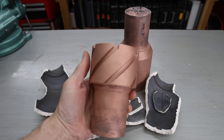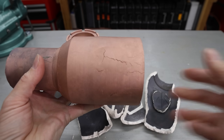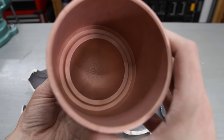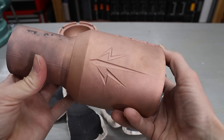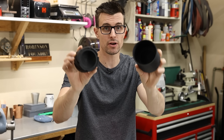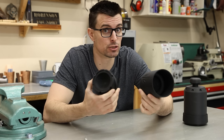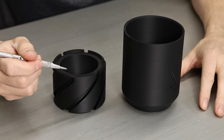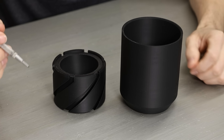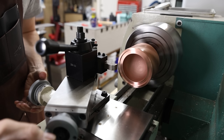These castings turned out excellent and I'm really happy they're finally done. The bell ended up cracking a little bit on one side and I think that was from shrinkage, but as far as defects go it's actually not that bad — I think it'll be a little bit interesting looking when I'm done. I got lucky it wasn't on my logo. When I was designing this thing I had to figure out a way for both of these pieces to fit together properly because they make up both sides of the sphere, and if they don't fit together properly then the sphere will be off center. What I ended up doing is adding a chamfer along this edge here — there's also a little ramp inside — and that'll allow these two pieces to fit together perfectly. Now I need to put it in the lathe and take little cuts until they fit together exactly right.